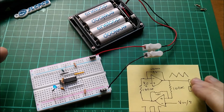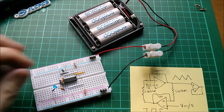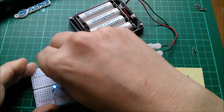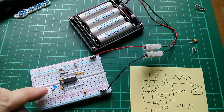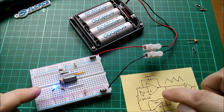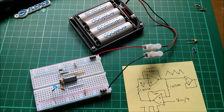Once I'd built the circuit and was happy with it, I thought: what can I do to move on from this? Then I kind of just regressed into my five-year-old self and thought, let's just take things out and randomly put other things in. I tried taking out the comparator feedback resistor — it didn't work — then I thought, let's try something totally wacky: let's put a capacitor in there instead of a resistor. And it works! That's a 104 so that's 100n — going a bit fast — let's try a 105, which is one microfarad. That slows it down. So now I've got a capacitor in the negative feedback of the inverting amplifier and also a capacitor in the non-inverting amplifier — capacitors in both.